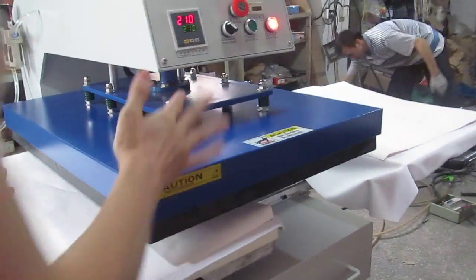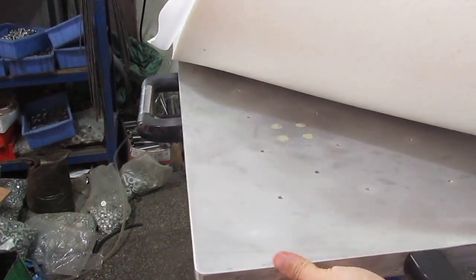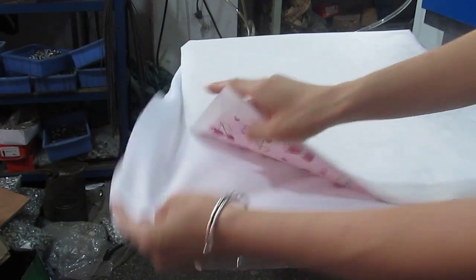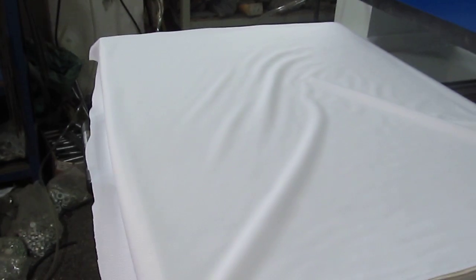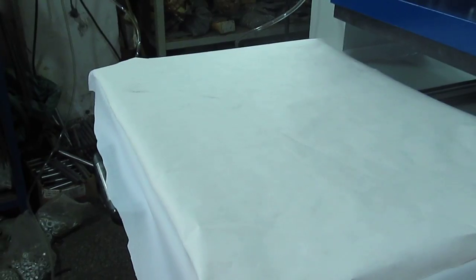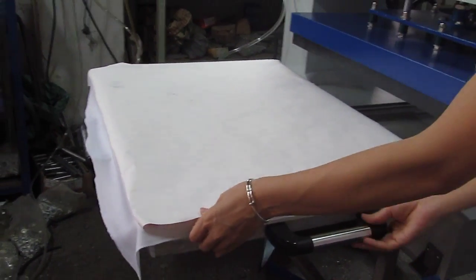Let's test the machine now. This is the heating plate. You can see the bottom working plate. This is the sponge, and this is the wool blanket. First, we have to place the fabric on the bottom working plate — it must be smooth, every layer must be very smooth. Then the sublimation transfer paper should be placed face down onto the fabric. Once displayed well, just make sure every layer is smooth, and then push it inside.